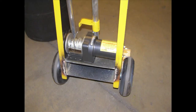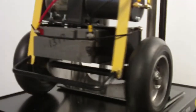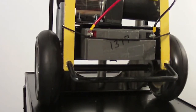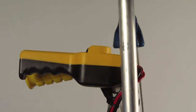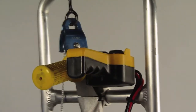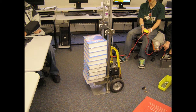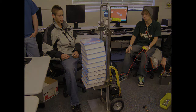We built a metal box, ten by three and a half inches, to house the battery and allow the winch to sit on top. This was a safety precaution that separated the battery and the winch. We also added a metal kick bar so Aaron could pull back the dolly while moving the load to the desired location. There was also a remote to operate the machine that we had to strategically place to benefit Aaron, and we decided to mount the remote by the handle on the dolly. After we retrofitted the dolly, we tested its strength to ensure it would lift the required amount, using books and propane tanks to lift 180 pounds that Aaron would normally lift on the job.